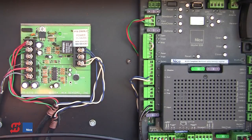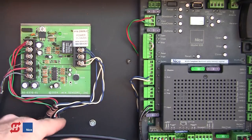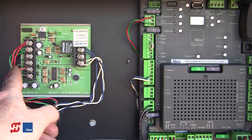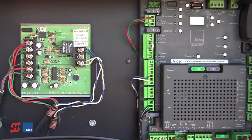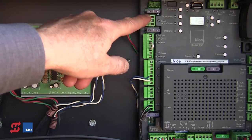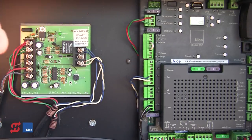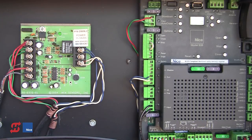The same applies to any other accessory, whether it's an exit sensor, loop detector, non-monitored photo eye, or hard-wired keypad. In this case we have an MFM exit sensor connected to a 100-foot exit sensor buried down the driveway, always installed in conduit to protect it physically. We need power, ground, and normally open and common connections to the board for activation. Our red and green wires connect on the left side of the board to 12V and ground, and our common and normally open connections go to the exit and ground terminals. We've also tapped wires going to a hard-wired keypad off of the exit sensor, picking up power and combining relay contacts.